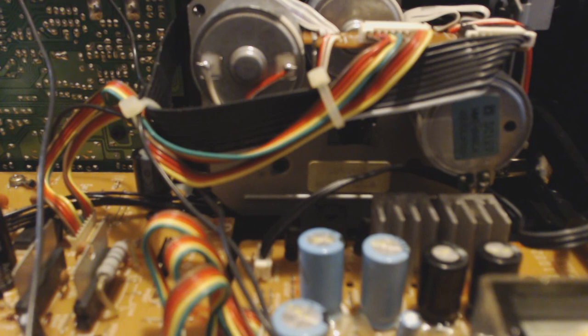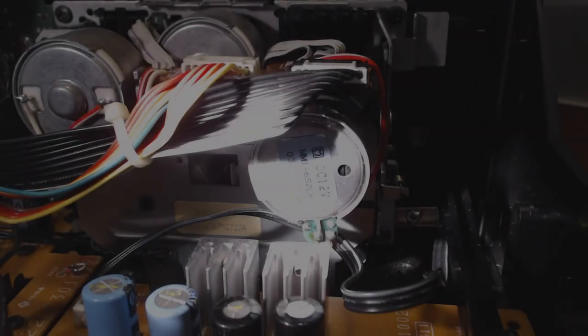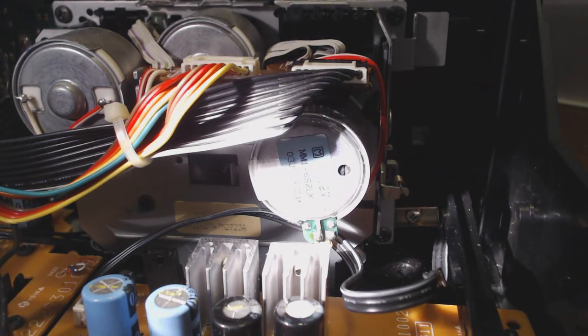If I overdo it, I'll need to dial it back just a little bit. After I've made the adjustment, I'll play my Eagles cassette and the minidisc at the same time by way of comparison — one in either ear. Hopefully I'll be able to tell reasonably accurately how close the speed is.